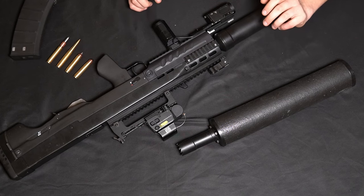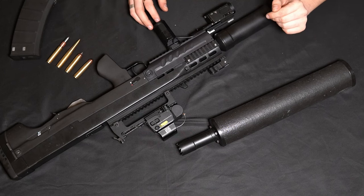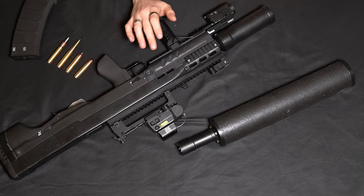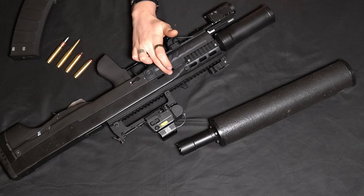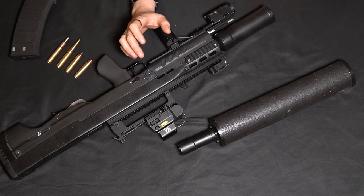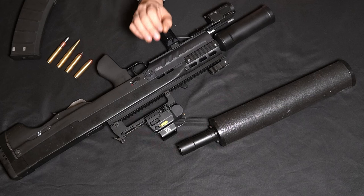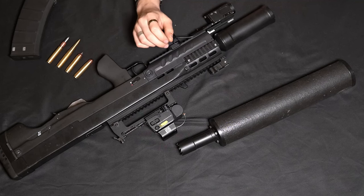After a short mental break, I decided to retry. But I always preferred the Shack look a little bit more, which made me rework the whole 3D model and go back to work. So I did everything again, but this time I tried to be as precise as possible with the cutouts. I made a spacer for the inside of the upper receiver and tack-welded the whole thing to a massive piece of steel so that the material had pretty much nowhere to go. Even then you have to be super careful with very, very little heat - but this time I was able to make this thing look good.